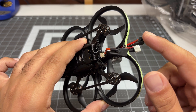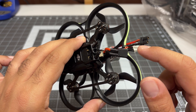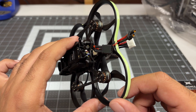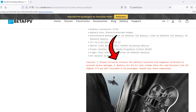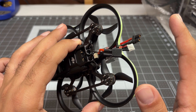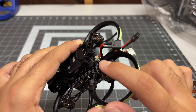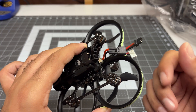When you're plugging in the battery for the first time, be very, very careful. You want red to red, black to black. For some reason on the Pavo 20 along with the Pavo 20 Pro, you are able to connect these backwards. I don't know why, but I did that on the Pavo 20 — luckily nothing burnt out. I did that again on the Pavo 20 Pro and I did burn out one component. Luckily it was a small resistor that I was able to change over.